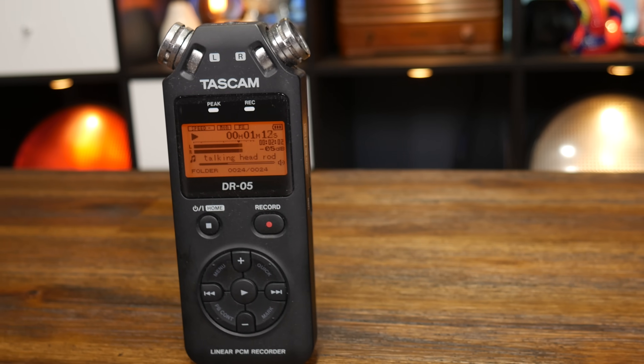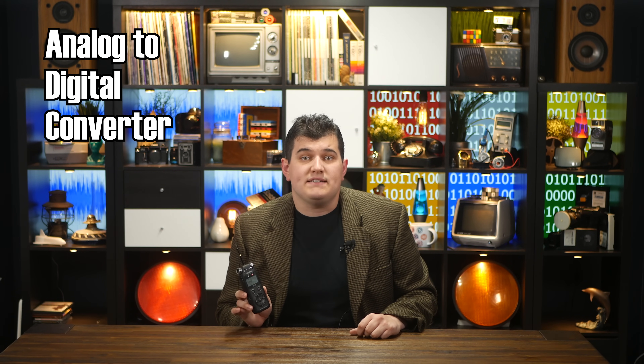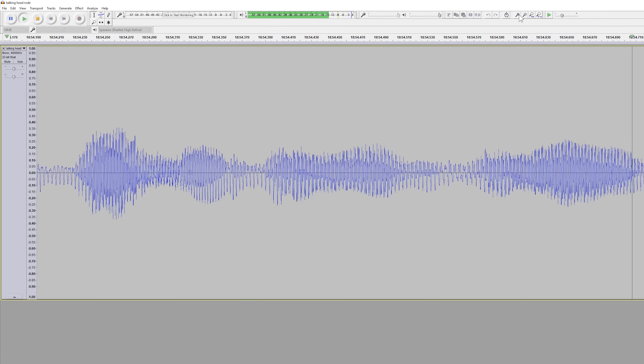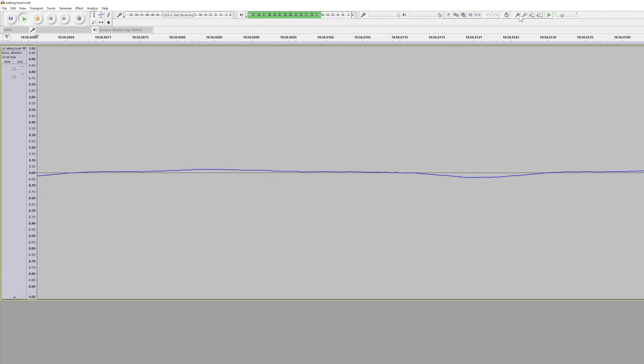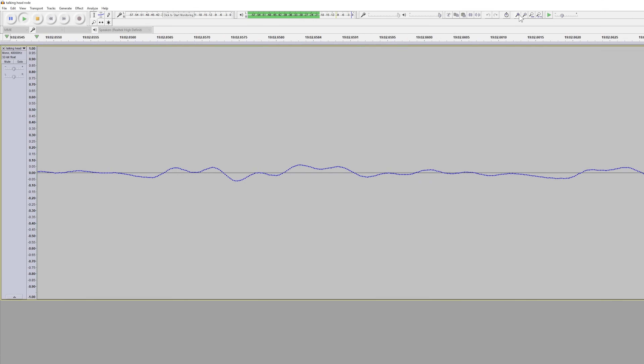The result is a string of numbers that logically represent the shape of the sound waves that exerted pressure on the microphone's diaphragm. It can actually write down two numbers at a time, since the Tascam has two microphones and records in stereo. Inside this recorder is what's called an analog-to-digital converter, or ADC — the actual device responsible for creating the stream of samples. It takes the analog signal from the microphones and converts it into a stream of discrete numbers. If you open the files in Audacity, you see what looks like a waveform — and it is a waveform, but one that's been plotted precisely on a graph. Zoom way in and eventually you can see the individual samples themselves. Digital sound is simply a huge list of numbers strung together in order.